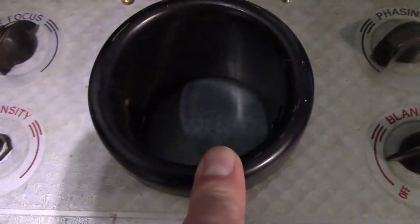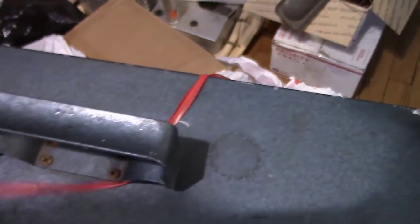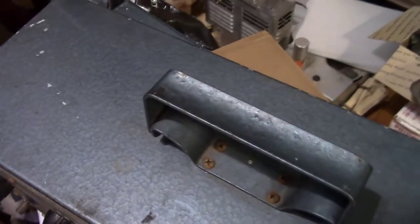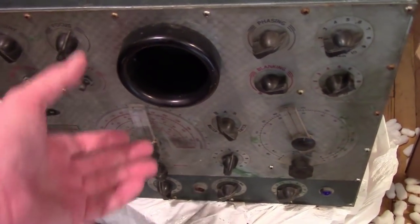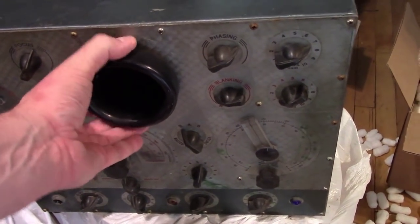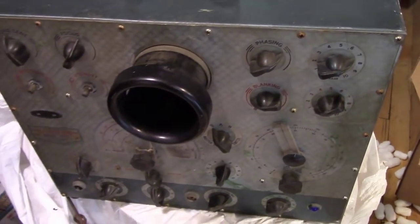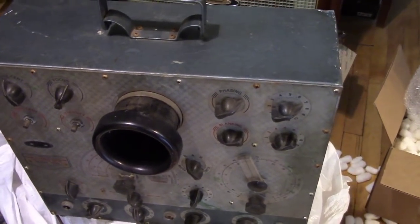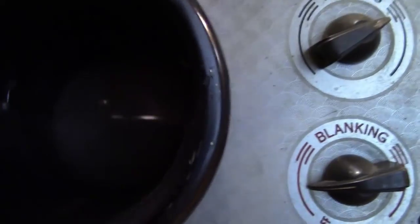You may notice — hey, there's no CRT face in there. What's going on? Looks like there's just a piece of metal back there. Oh yeah, that's one of the novel things about this — the whole thing is kind of novel. There's only one other sweep generator I know of that had a built-in scope, and it was not this compact. The reason it's compact is because when you use it, you swing this out. I should have known better — I was just reading the owner's manual for this before: you pull the back out first, then you pull this forward. And yes, I do have the full manual — schematic, really nice condition, really detailed service info. So with this pulled forward, good deal — and there is the CRT face.